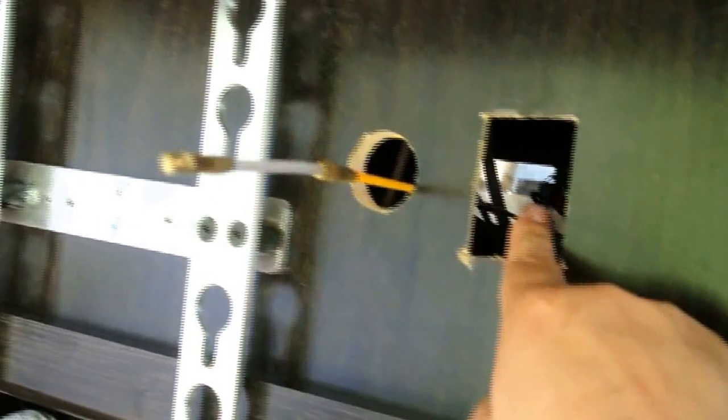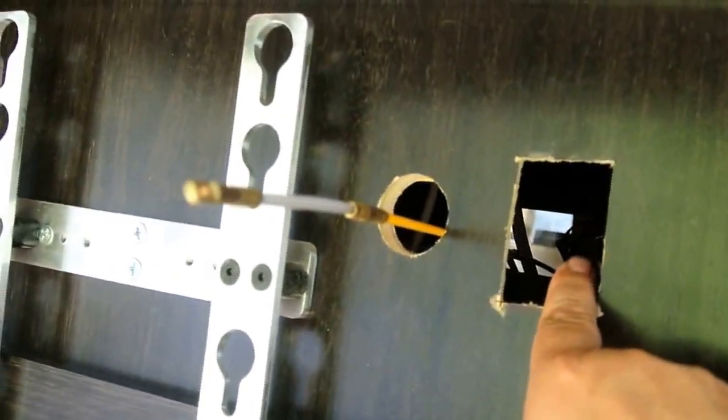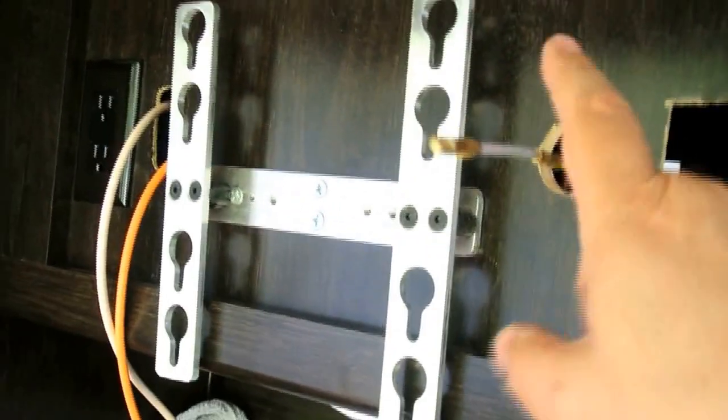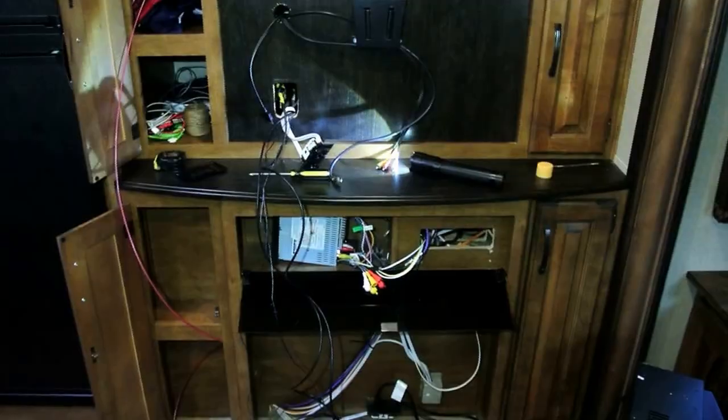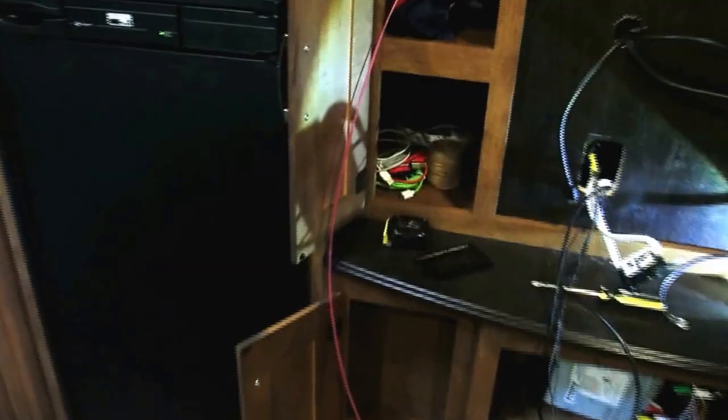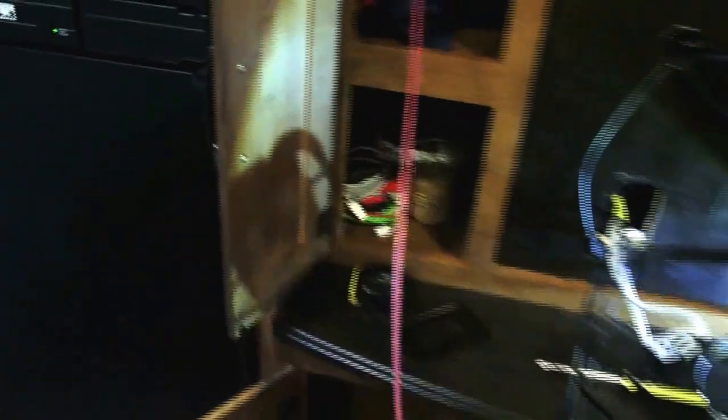I have three sections of the wire pull rod going through — you can see the back of the stereo on the inside, and it's coming through to the hole here. Sometimes you just have to take everything apart to find out where things are going. I'm also using this pink nylon fish tape, which is another really handy tool to have. I had to pull out this outlet to get behind it to fish the wire, and it turned out to be all busted, so I'm going to have to stop and replace that.